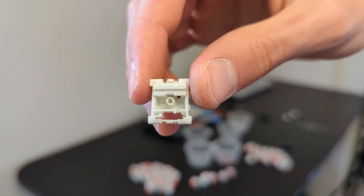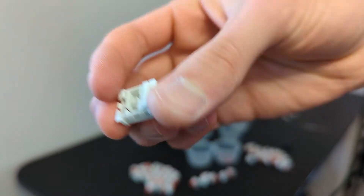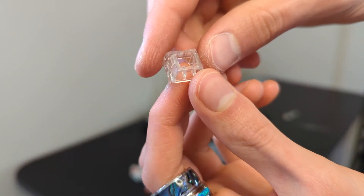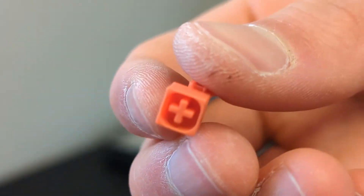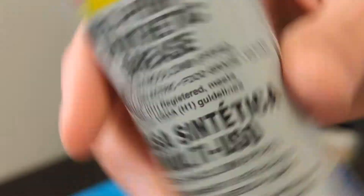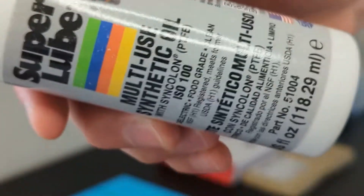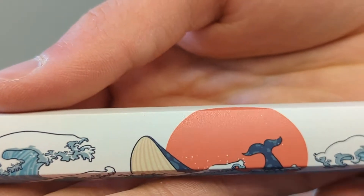While lubing the switches, I found the box compartment in Kailh Box switches, which is in the lower housing — which I accidentally opened for a couple of the switches and low-key panicked because I didn't know how to put it together at first. But that little nubbin just kind of falls in place, and then you put the lid back on. Very scientific. For lube, I used Superlube 21030 and 51004 as substitutes for Krytox 205G0 and 105G0 respectively.